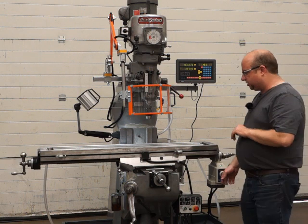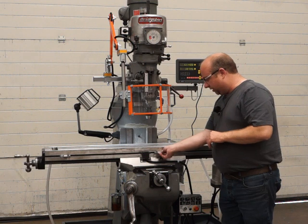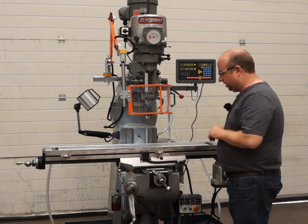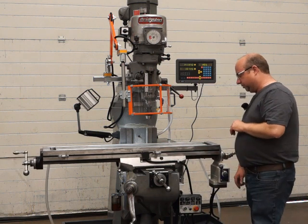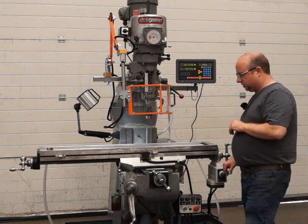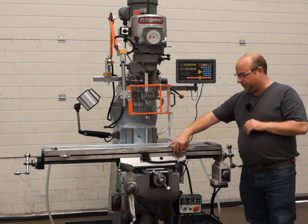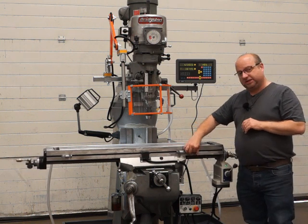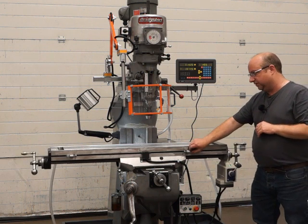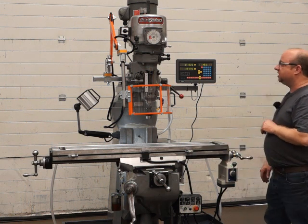And it has these stops in the middle, so you can adjust these to wherever you need them to be, wherever the job happens to be. And when the stops touch the micro switch in the middle, it will shut down like that. So that's really handy. Okay, so just don't take these stops off, and also under here there's hidden ones. Don't take those off either, and you'll be absolutely fine. Just make sure the apprentice doesn't take them off either, if there happens to be an apprentice on the machine. So yeah, critical you don't take those off.